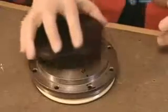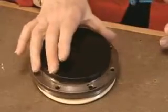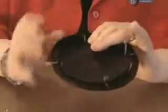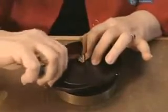These are lubber lines — small direction markers. They're inserted into holes in a jig and lined up with holes in an aluminium gimbal pan. The lubber lines are pressed into the pan. Two pins that allow the ring to flip around the gimbal pan are inserted into the gimbal ring, then the compass dial is attached to the gimbal assembly.